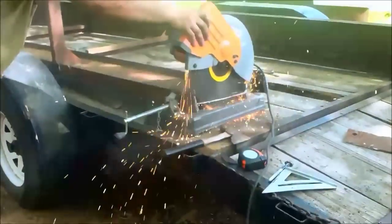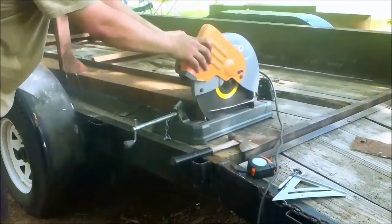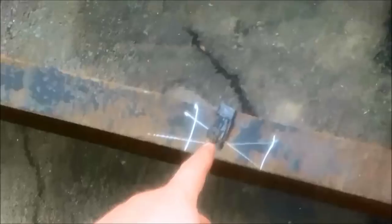Got them spaced out a little. As you can see, this one's not bent really at all, but this one's a little wonky. Here it is laid out — I leveled a 4x4 post on each end. As you can see, this is the one that has a slight bend in it, but I've marked where the bend starts here. The apex of it is right here in the middle. I figured I'd weld it here and figure out the distance, which I believe is 29 and something, and then make supports and use a come-along to make sure it meets exactly where the support is. And then as I keep working down, I'll work out that kink.